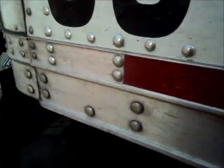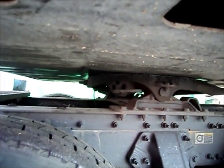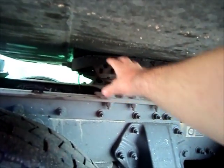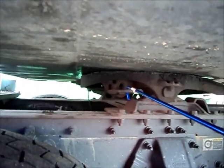The first step in disconnecting and uncoupling the tractor from the trailer is to release the fifth wheel lock — the fifth wheel jaws — on the rear of the tractor. There's the release handle there; you grab that and pull it. When I first started driving, that's what I would do every time: reach under the trailer and grab that handle and pull it to release that fifth wheel lock. However, over time I discovered there's a tool you can use to reach under the trailer and grab that handle on the fifth wheel and simply pull it, which will unlock the fifth wheel jaws.